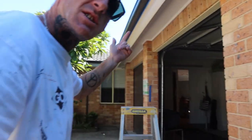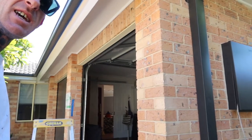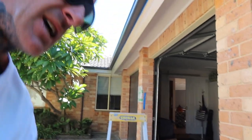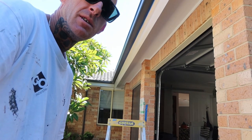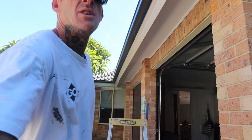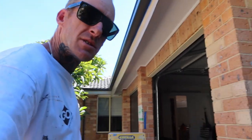You can see I've gone through and taped it up. On this one I finished the soffits, or the eaves, first, then I taped up the back edge of the soffit and sprayed out the fascia twice, then taped up the front edge of the fascia like this, and then sprayed out the gutters two coats.